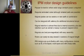The rotors can be easily skewed. You can make the magnets in short sections and stack the laminations in the same length, and then you can step skew these groups. So that's good for a good sinusoidal output and low torque ripple. Although torque ripple with this kind of an IPM rotor is not as serious as it is with the surface mount machines. Not torque ripple, cogging torque I'm talking about. Cogging torque is not so serious with this because you don't have distinct poles to line up. A little bit, but okay.